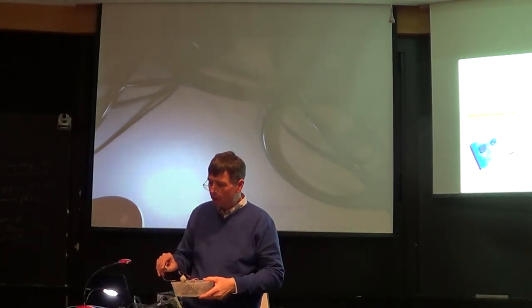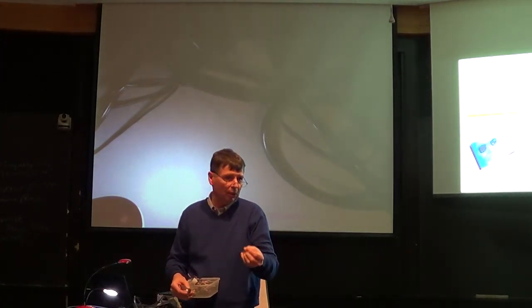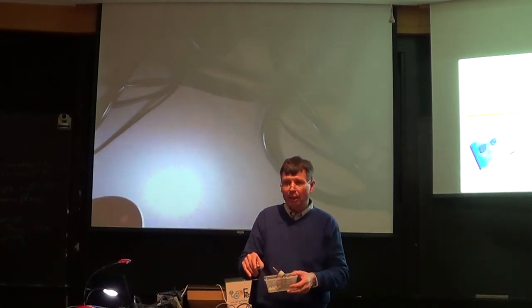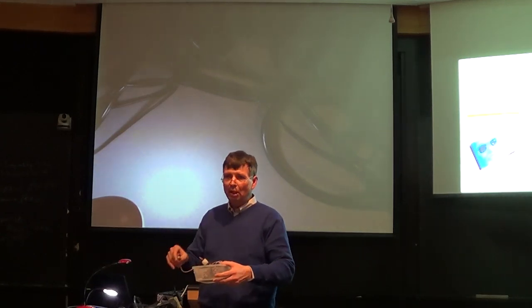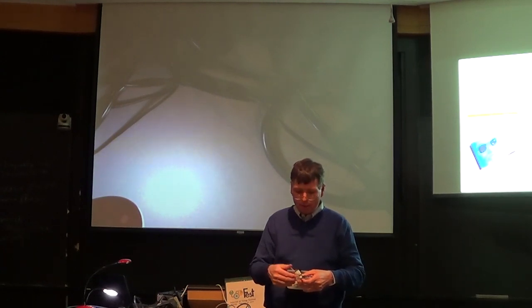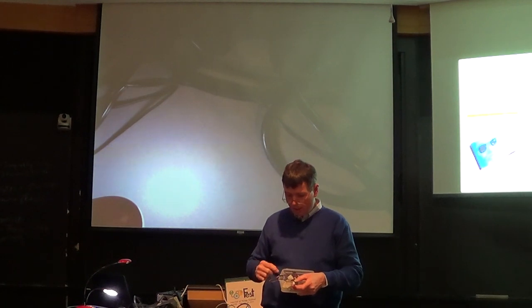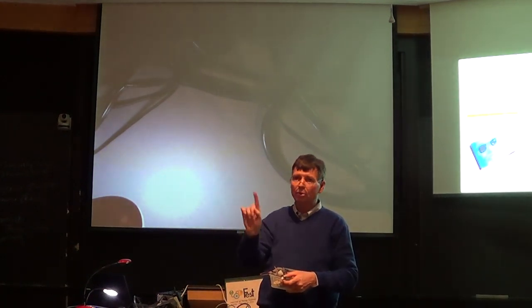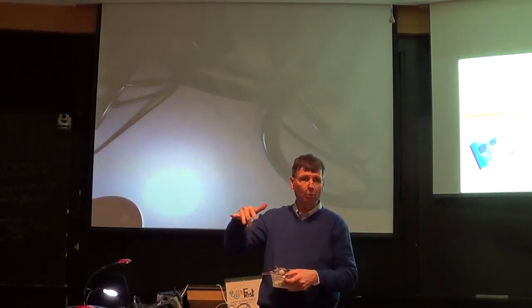And with these bricks, you could buy the components and create the circuits or breadboard them yourself. But for a few dollars, you actually get these almost Lego-like electronic components to plug and play. A key thing is getting these nice three-wire connectors that plug right onto the board. Then you can take those three-wire connectors into direct wires with little connecting points and plug them right into the Arduino headers.